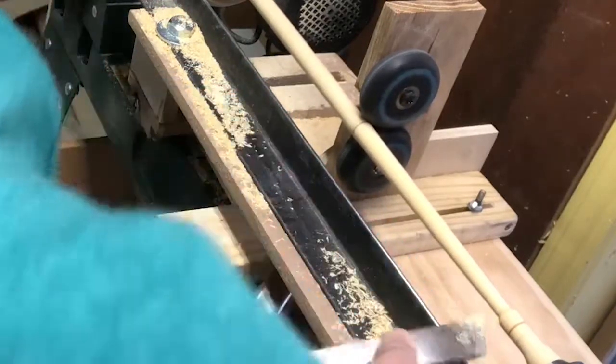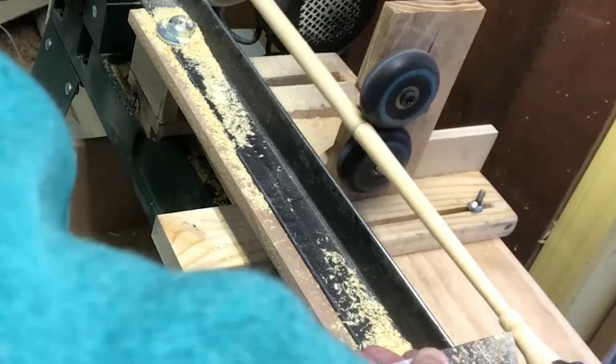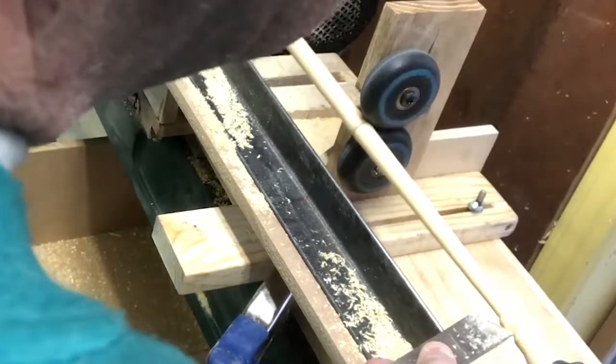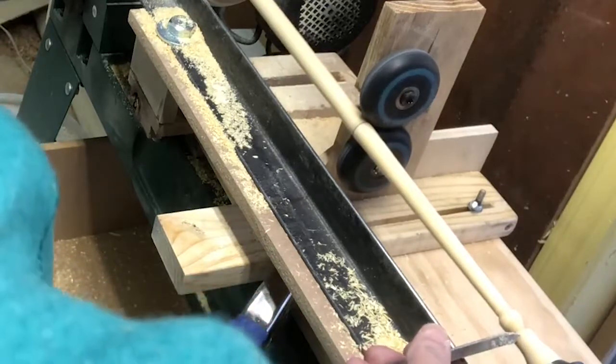Now I've increased the speed just a little bit. I'm actually using the skew tool to make the head of the drumstick — you can kind of see that there. I've got it tapered. And now I'm going to back up the spindle rest here in just a second because I don't need that anymore.